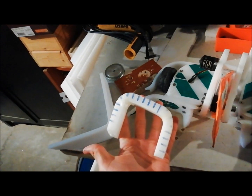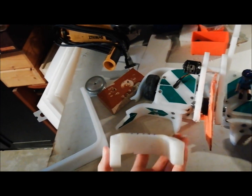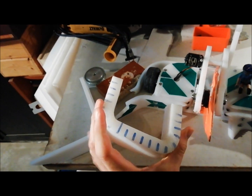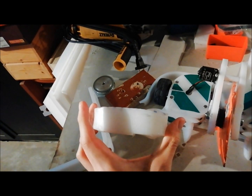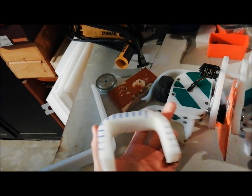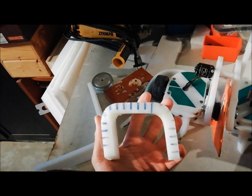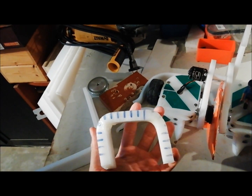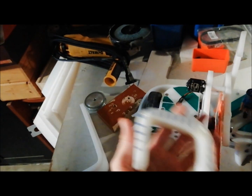This is a piece of 15mm HDPE. When I started making this chassis for 'Wu,' this was the first time I bent HDPE for a chassis. What I did was take a cut-off piece of 15mm HDPE, mark it every 10mm, and just start bending to see what it would do to the material — how many millimeters would go into the bend.